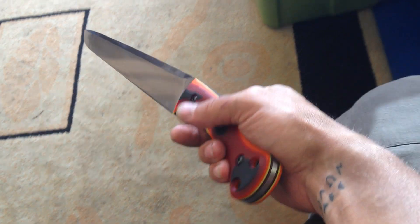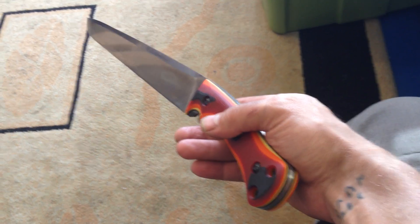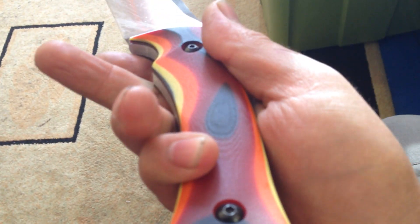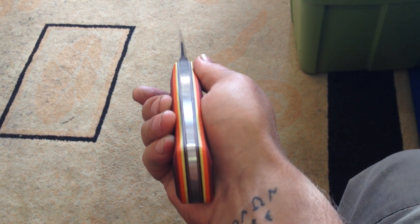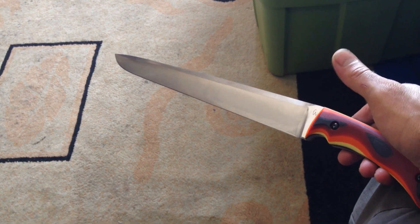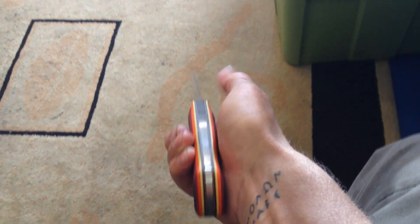I can't regret that I didn't do the same thing on my Wacky. It just looks better when it's dark, when it's natural. But honestly, when I'm out and about, I leave the knife somewhere in the shade or stuck in a tree or something, and it's always easier to spot it with a brighter handle. So this one's gonna be perfect for it. It's nicely contoured, very comfortable, heavy sandblast so it has a nice texture to it, and it feels great in the hand. This one is actually a tapered tang — that was another thing why I was really pissed that I don't get to sell it, because I've tapered the tang on this one. It starts with like 5/16s, a little over 5/16s thick. It was a pretty cool piece — nice grind, nice swedge, and a tapered tang. It would have been really cool, and if everything worked out, I wouldn't do the crazy color. I would do something that everybody liked, either some nice wood or carbon fiber. We learn — not everything can go perfect, and this happens.